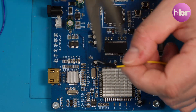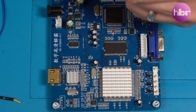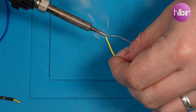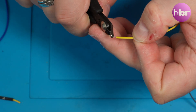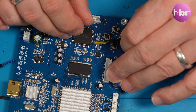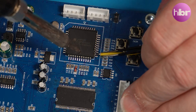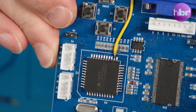The next step is connecting the debug pin. I'm making all the connections in this case using Dupont cables, as I have a huge box of them that seems to keep growing. The debug signal is a single connection sourced from pin 30 of IC6, which is the MTV230 microcontroller. This chip, originally designed for embedded applications in LCD screens, serves as the stock brains of the GBS upscaler. In the GBS Control modification, the MTV230 is overridden by the ESP8266, which allows it to take direct control of the TrueView 5725 video processor — the component responsible for core video processing tasks such as scaling and converting input signals to the desired output format.